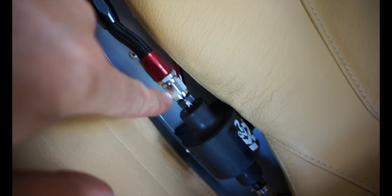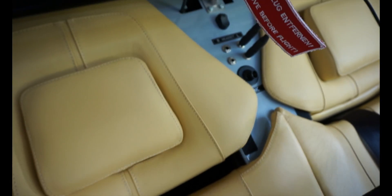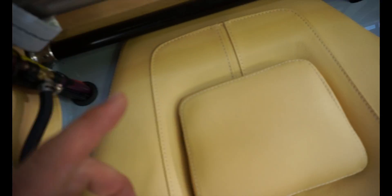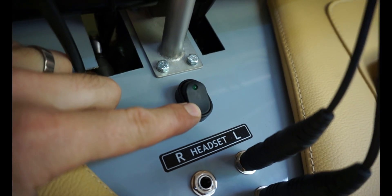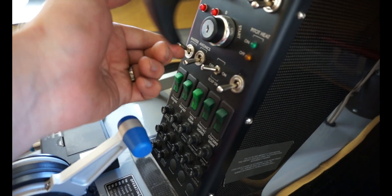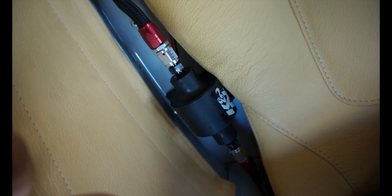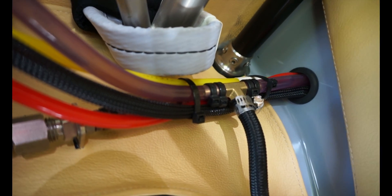I wired it — there are wires going through this wall, plugged into 12-volt power. It's on a separate fuse on the DC converter fuse down here, and it's going to a switch which is located right here that I installed. This will give me an indicator light when it's working — when there's power on it, it's going to turn green. That's going to be pretty helpful because I can't hear the fuel pump when the engine's running. Just going to turn on the master switch — there you go, you can hear it working. You can see the fuel going in. Looks like it works.